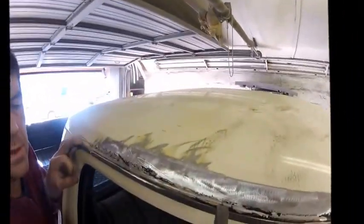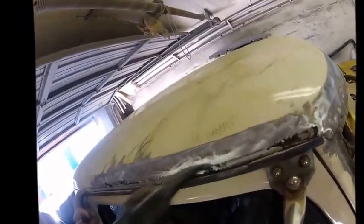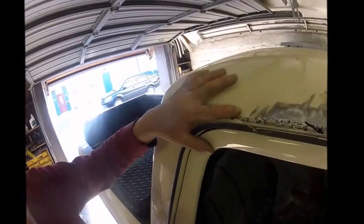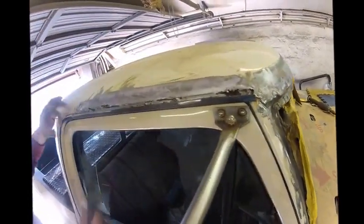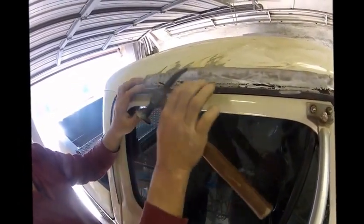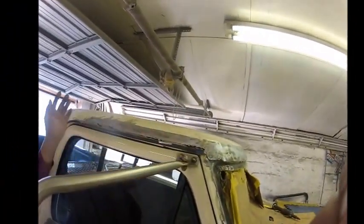It didn't peel the way already. Look — I just chipped it right there and there's no rust showing there. Look, there's rust. Chipped it right there, look, there's rust. There's rust behind what you see, and it's from those holes in the front where the moisture built up underneath here. Moisture rises, and when moisture rises it can't get out of this roof. The more it keeps rising, it never gets out — it coagulates, the humidity densifies and gets right here underneath this clip, and it rusts.